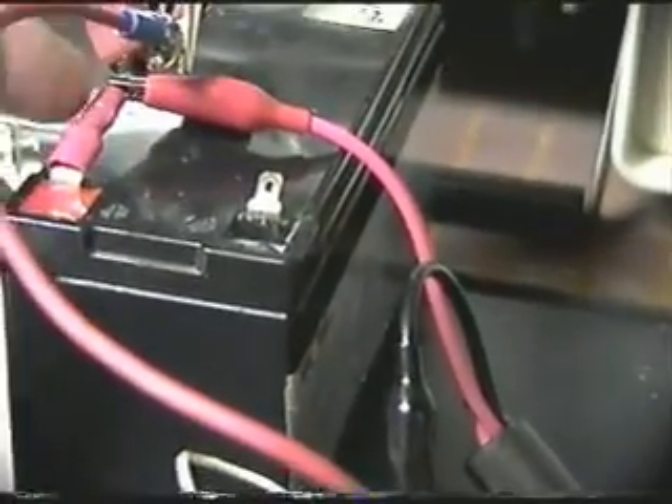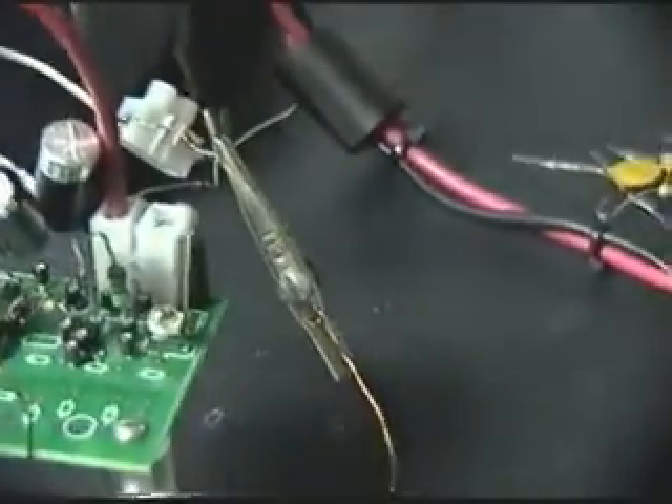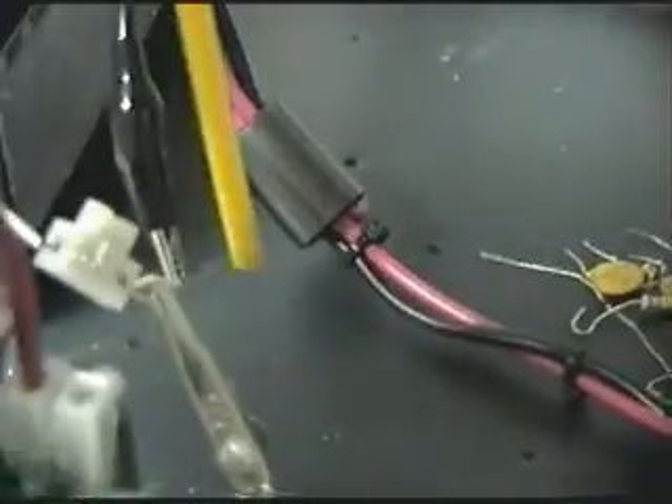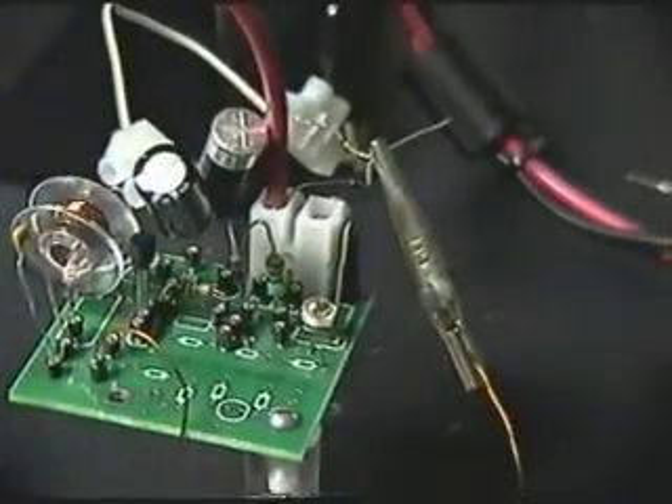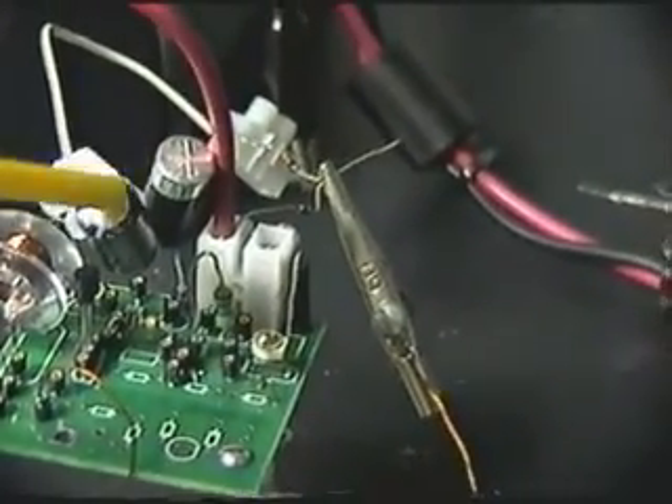I'm not going to use a battery, but I am going to use the fuse that's on the battery. So I have the plus coming from the power supply hooking to the plus of the battery, it comes out of the fuse and goes into the hybrid exciter. The negative comes down to the negative of the battery, which is also the junction of CA and CB. I don't have these permanently mounted mainly because CB is already starting to puff out the aluminum can on the end. This is a prototyping board so everything is socketed.